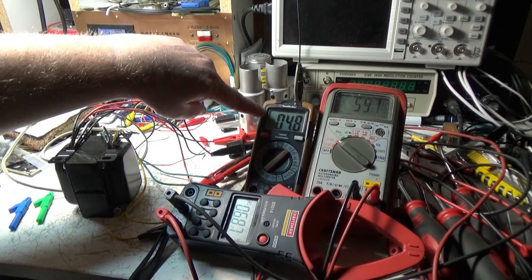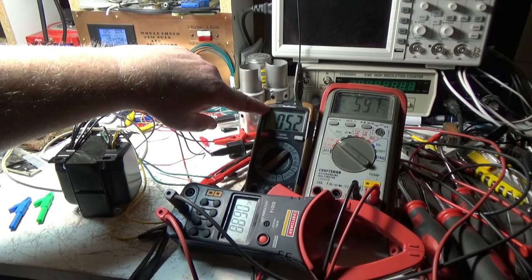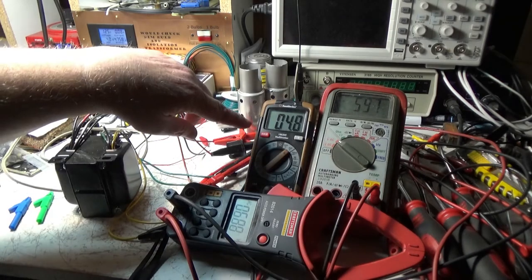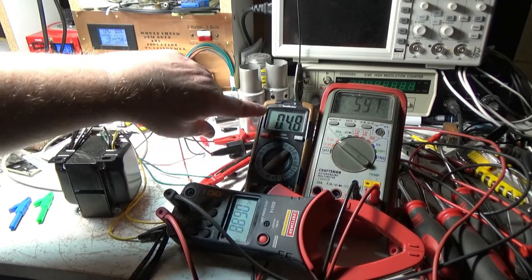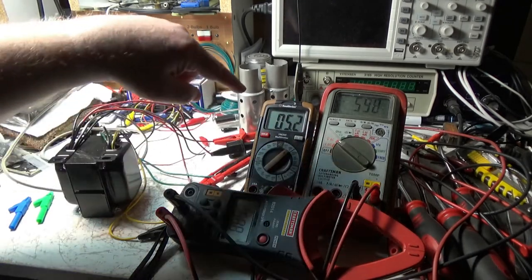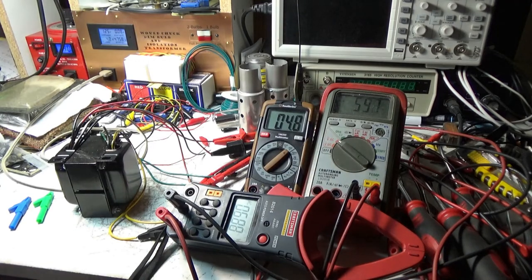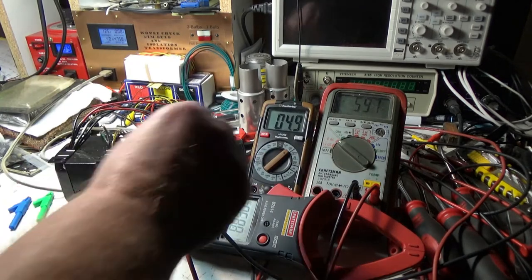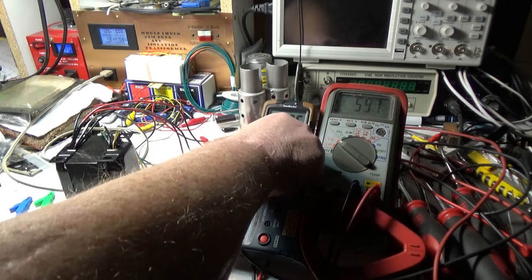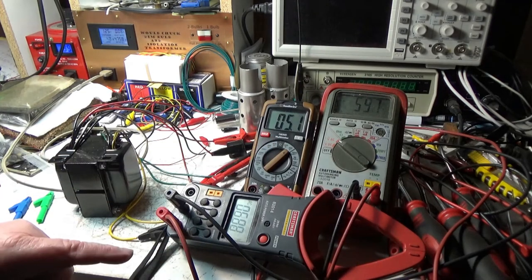This is the 5-volt filament for the rectifier tube. And this is the 6.3 for the rest of the tubes, and these are unloaded. And these cheap voltmeters here, I've checked this south wire with this meter and this meter, and this is a little bit over, right around 5 something. I just don't trust this south wire. If I put it into the 600, it's not going to show. It's still fluctuating, and I don't understand why, because it's rock solid when it's hooked to these other two. I don't know why the AC is screwed up.